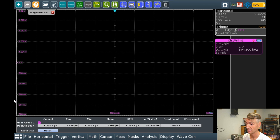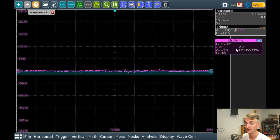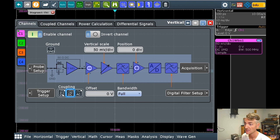First things first, when you're dealing with the oscilloscope, let's preset it, because I am not sure what I was doing before. I know that I am using a near field probe, so I need to change the coupling to 50 ohms to match the antenna, because I'm using a 50 ohm near field probe. I need to make sure that the scope is set up for 50 ohms. I'll use the full bandwidth of the scope. We'll probably move the bandwidth settings around a little bit, because I know that we're going to see some interference